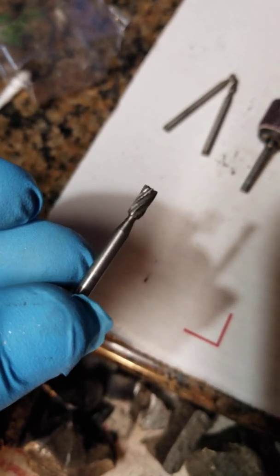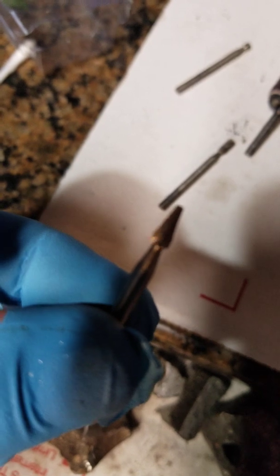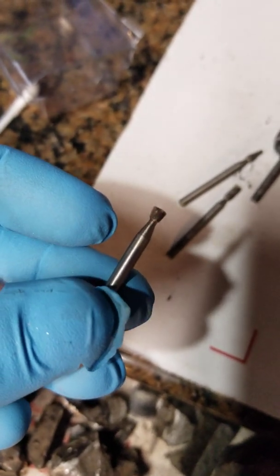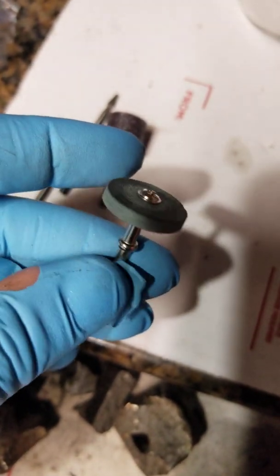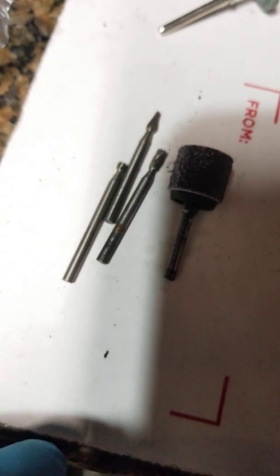This is the one I'll probably start with because I can remove the most material with it. Then I've got another one I use quite a bit too, just because it's got a tapered point on it — I can really get in there and get some precision done. Then I've got this one that's kind of tapered the opposite direction: fat on the end, narrowing down toward the neck. I use all three depending on how the initial bulk removal goes. The problem with the sanding barrels is the aluminum gets gummed up in them, so typically this cutter bit is really all I need.